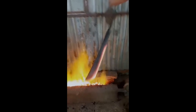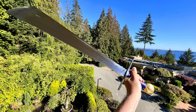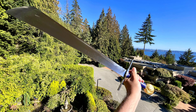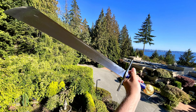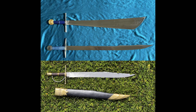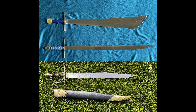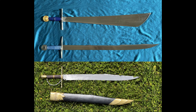It's a very well-made, hand-forged, hand-crafted sword. I just wish the maker could stick to the design of Brother Nathaniel and taper the blade further down to the 2 millimeters specified. With the existing fuller geometry, a significant amount of mass could be reduced from the foible of the blade and added to the base by having a gradual transition from the rectangular cross-section to a convex geometry, eventually transitioning into the fuller cross-section on the upper portion. So the sword overall would be better balanced and rotate better. It is still a fascinating fantasy sword and I'm very grateful for the opportunity to handle it and assess it before even the designer and owner.